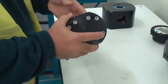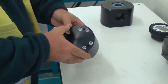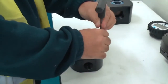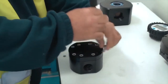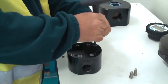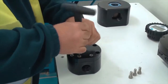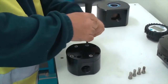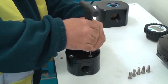The second part is to turn the meter body over, which will expose the eight bolts that hold the meter together. To disassemble we need to loosen the bolts and we generally do this in a cross pattern — undo one and then the one in the cross pattern so that it comes out evenly. We do a criss-cross to remove all the bolts and this will expose the internal parts of the flow meter.